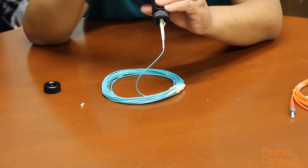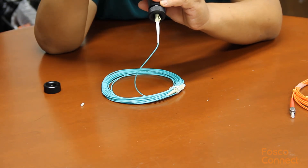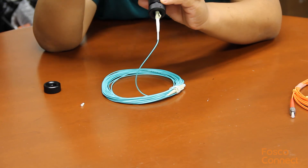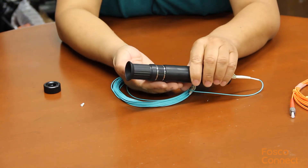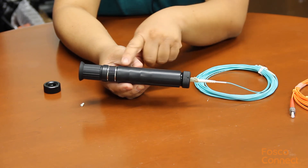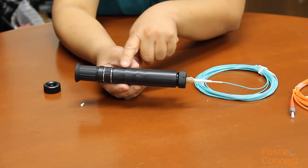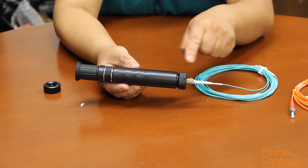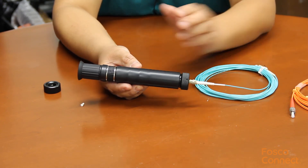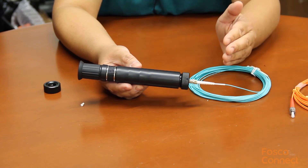By fine-tuning using the view, you will see the end face clearly. You can also switch between two illuminating modes. The first mode is a directly coaxial mode, so it has bright light directly shining on the fiber end face. It is very bright, but that could hide some debris and other defects on the surface.